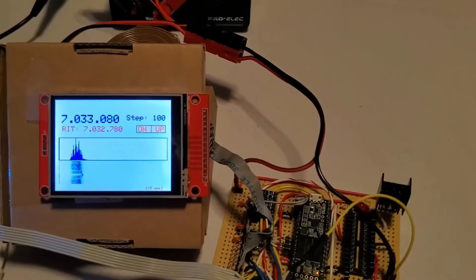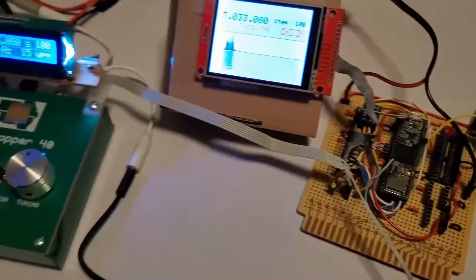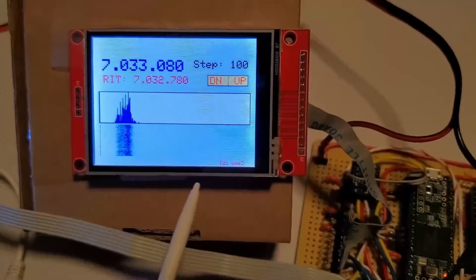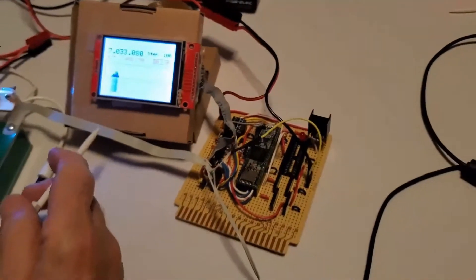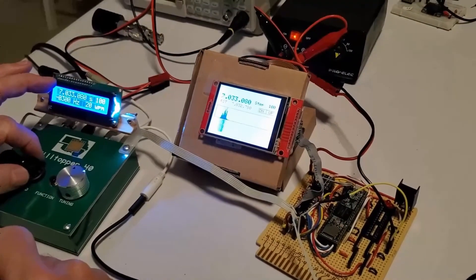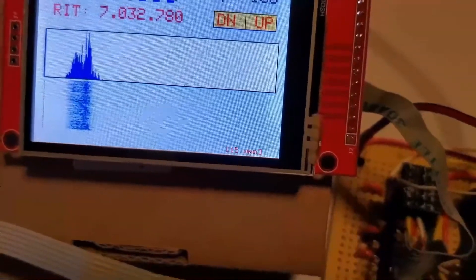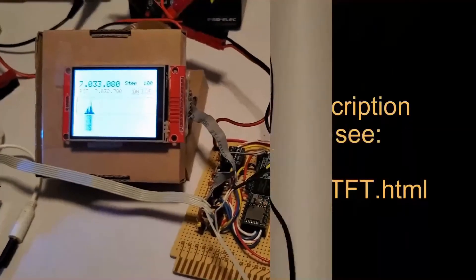He got him! Well, there's only so much you can show about it. I can turn the speed here and it goes up over here — that's because I'm using those Z commands I made up. I made up a couple of Z commands that are CAT-controlled commands, but they're not part of any standard. I don't think there is any standard, truthfully — each vendor does their own thing. There are some commands that are similar from one to the next, like the frequency commands FA and FB, the VFO commands.